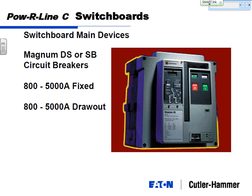When you're opening and closing a breaker, there's a good chance of a fault. You're standing in front of the gear, you're manipulating devices, something could occur. When you're talking about the Magnum family of insulated case or air power breakers, you can electrically operate them because we put a spring mechanism and a charging mechanism in there. And that allows you to put an open and close switch on the wall, maybe around the corner, to run that circuit breaker.